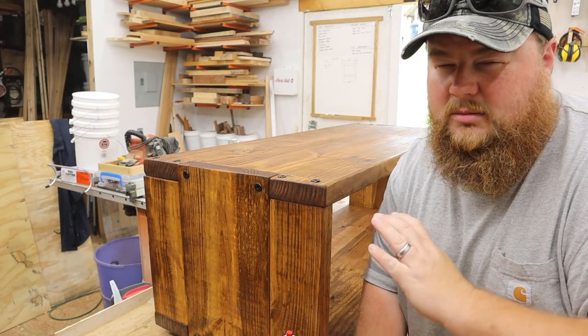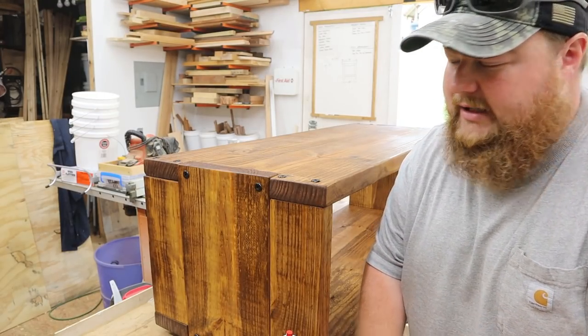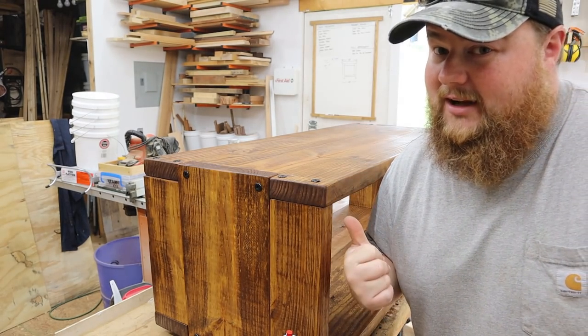I've got all of this coated. I'm gonna let it dry for a while and come back with a green Scotch-Brite pad. Lightly scuff this to kind of sand it, and then I'll do a final coat, and that will be good enough.